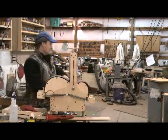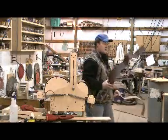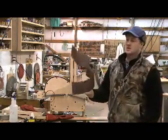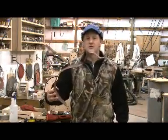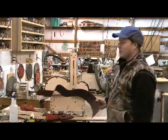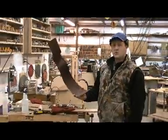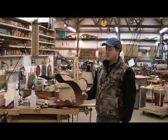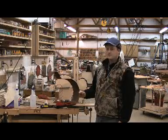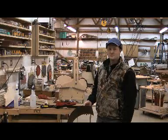When you have completed, this is a couple of different sides that we've bent. This is actually a piece of rosewood, but once you've bent it, it will stay in the form that's been made from being in the heat press. And so once it's formed, then you can take it on to glue in your head block and your tail block, and then on to kerfing. So that is a demonstration of basically how to bend the side.